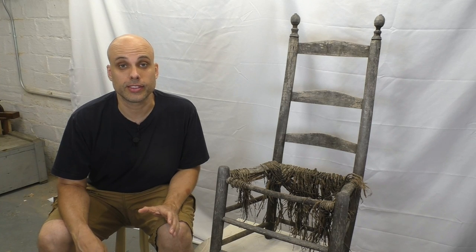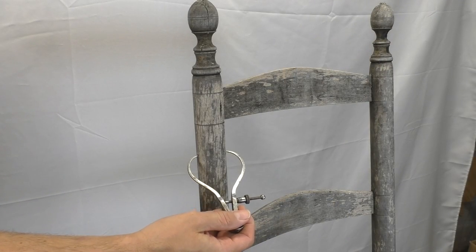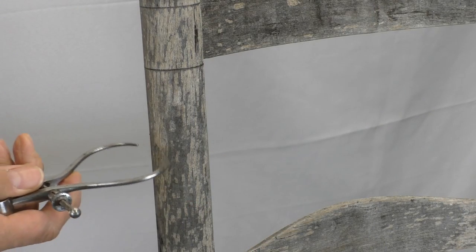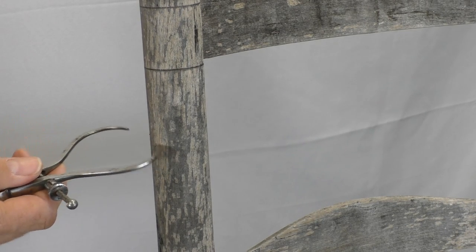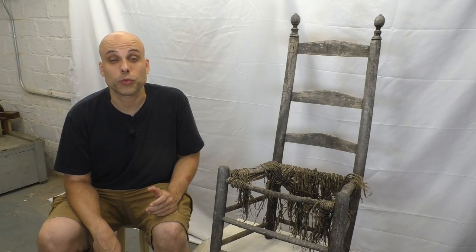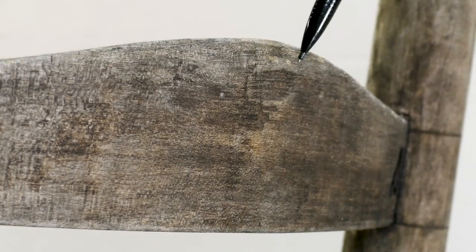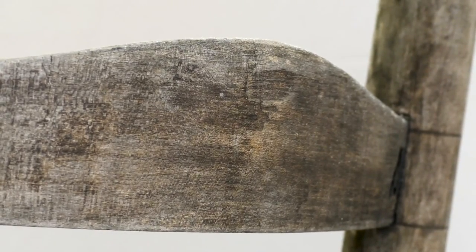This chair is definitely an example of green woodwork. When wood shrinks, it always shrinks more in one direction than the other — you can get calipers to slip on in one direction, but rotating them 90 degrees reveals the post is thicker. Green wood dries into an oval shape because of that differential shrinkage. This chair also has really clear riving marks — places where the grain pulled out a little during splitting and left an uneven surface, especially visible on the back of the chair slats. There's no question all these pieces were split from the log.